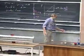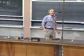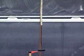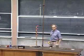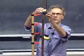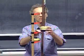You'll be surprised how many springs really behave very nicely according to Hooke's law. I have one here. That's not a very expensive spring. You see it here. And there is a holder on it, so it's already a little bit under stress. That doesn't make any difference. These marks here are 13 centimeters apart, and every time that I put 1 kilogram on, you will see that it goes down by roughly 13 centimeters, down to this mark. I put another kilogram on, goes down to this mark. I put another kilogram on, and it goes down to this mark, all the way down.